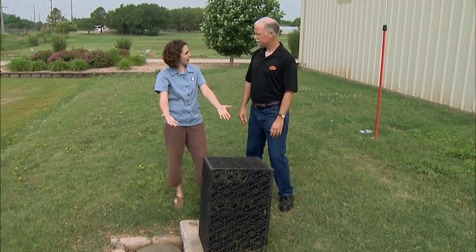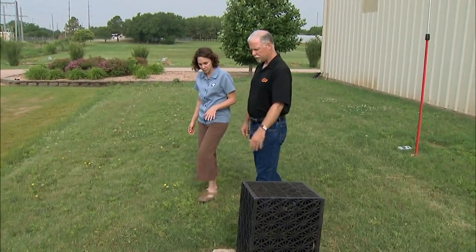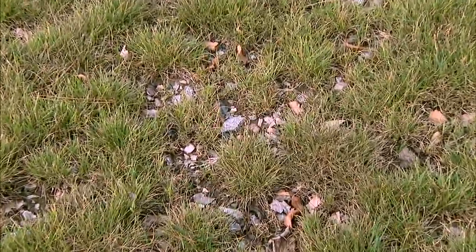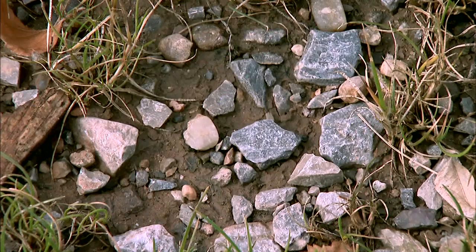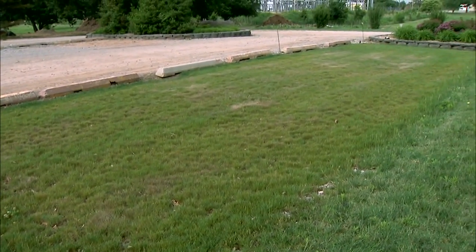It's important to note that that's non-potable water — we can't drink it. It's untreated rainwater, but it is being circulated all the time, and it makes a very attractive feature as well. If the water fills up past 500 gallons, it overflows into our green parking lot. This is created with two feet of Cornell structural soil mix — a mix with stone, hydrogel, and 20% soil so that the roots can grow through it. The stones bridge against each other and provide big void space. The hydrogel sticks the soil to the stone, and then the roots can grow through that void space. We're going to put Bermuda grass on this summer and have a green parking lot, allowing people to park here while the water infiltrates through. Stormwater mitigation is a really important issue, and this could help with that.